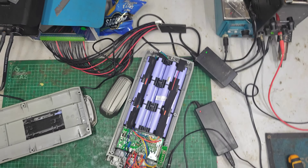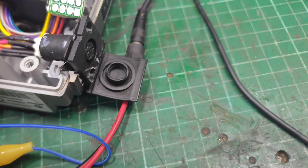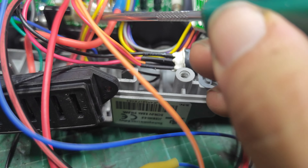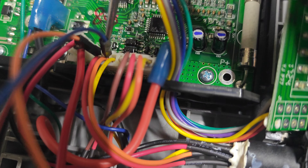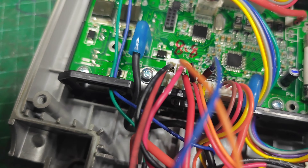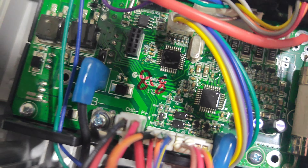So if I pop you off this, I should be able to show you up close. Look at all the wires — so many wires. This pin over here says ID, this pin here says common, and this pin here says temp. I've got my little DuPont connectors in the two leftmost ones — the red wire for ID and the orange wire for common. So that is ID and common shorted together. Then the charger is hooked up to the charge minus and the charge plus, just there.